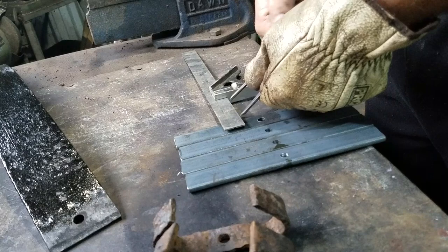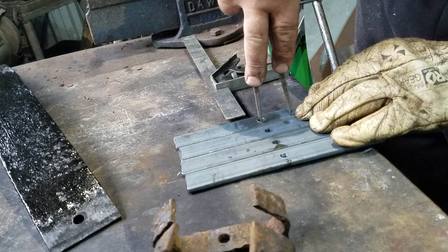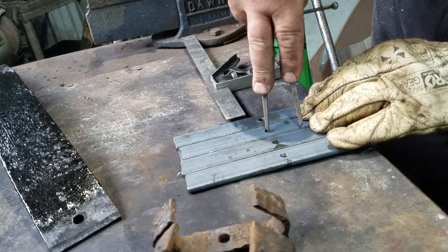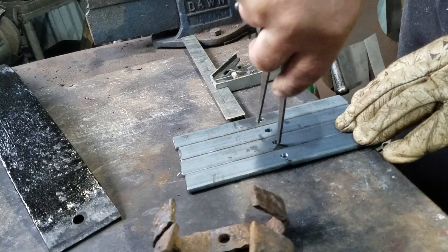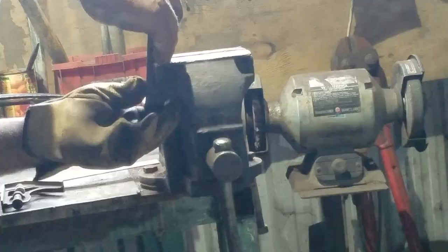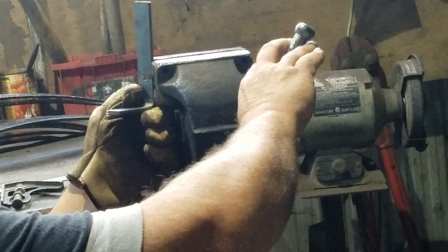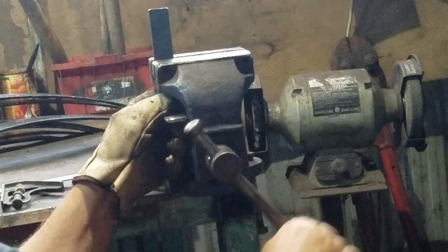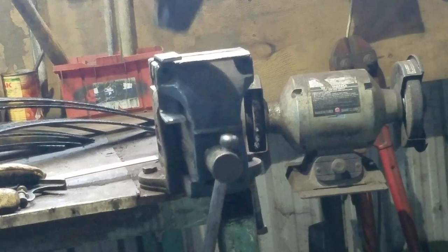The next thing to do is to mark out where the bends are going to be, so I can pre-make the first two bends before riveting the straps on. It's imperative that you set them up in the vice the right way, so that the bent part is on the outside of the jaw — that way you don't end up making something tighter than the width of the spring so it won't fit over it again. The measurement of 63mm must be retained for the spring to fit into.